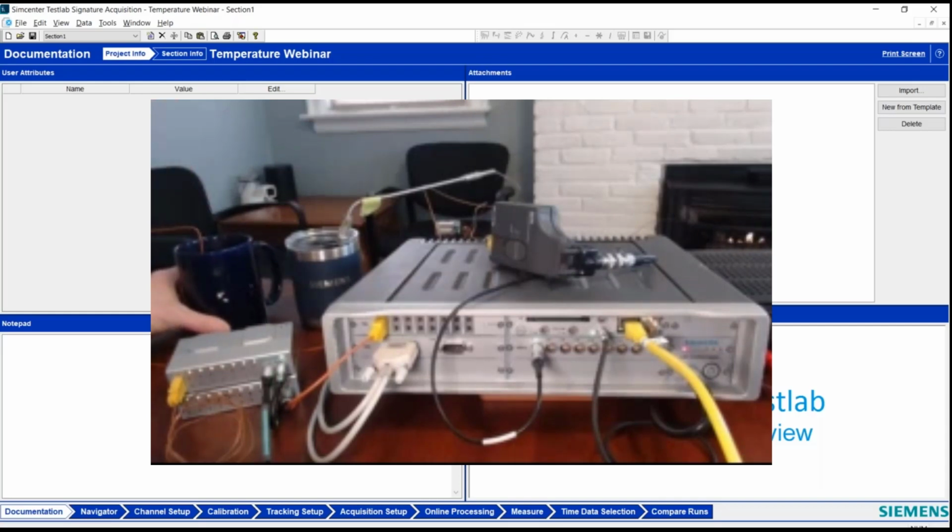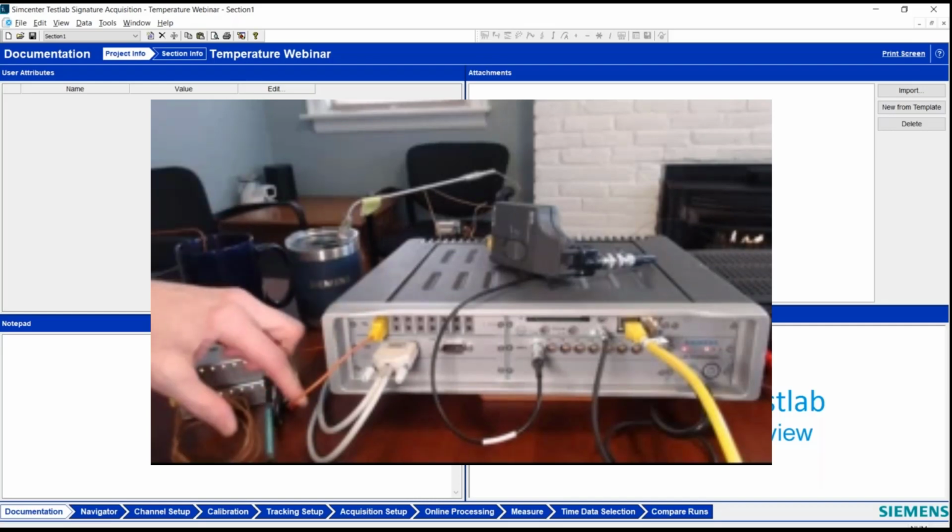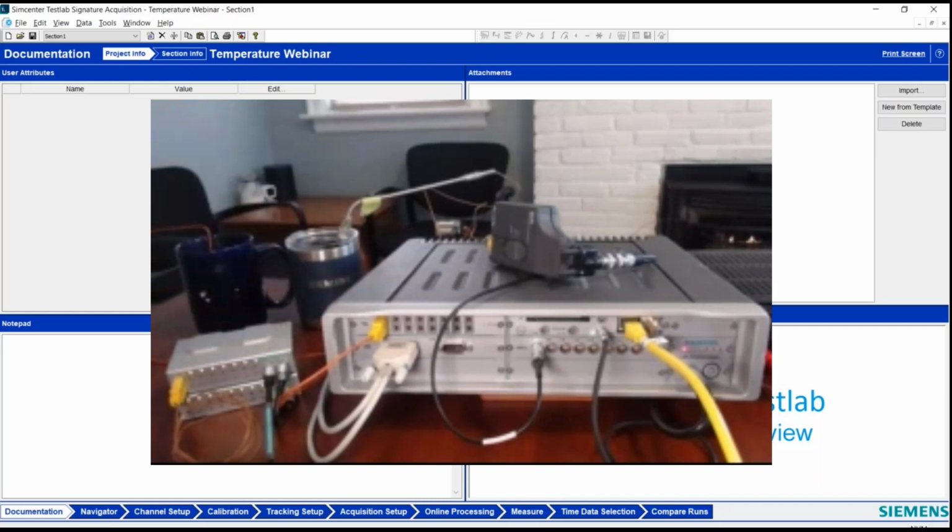It's a little bit of an Easter egg for those of you that may have really good imaginations and can figure out what that logo is that's no longer on the cup. So that's what the T8 card is wired into in that regard, and I just plug it directly in. You'll see in the software I pick which thermocouple type I have, and I'm making that measurement.